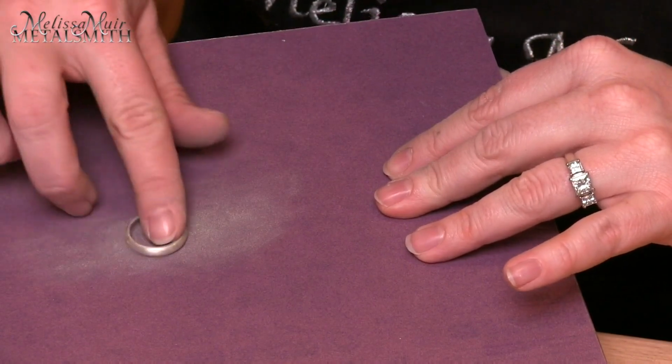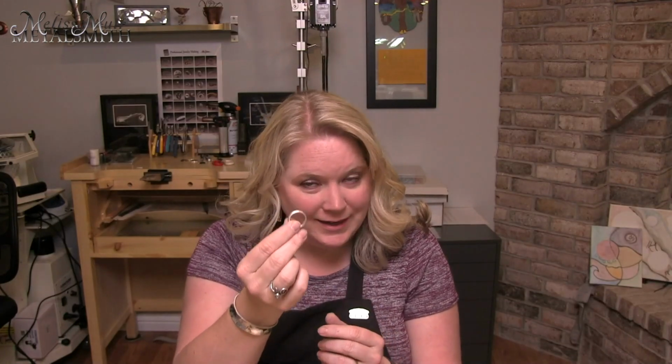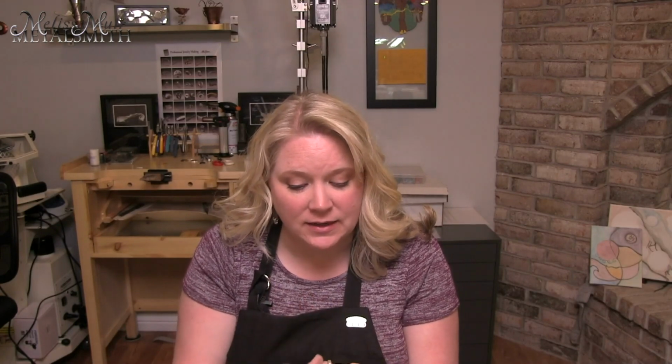All right, that's looking really good now. At this point, we have a nice, perfectly round ring. At least that's our goal, is to have that round ring. You can no longer find the seam inside or out because you've cleaned that all up. At this point now in my ring, everything has been sanded. I have Scotch-Brited the surface. That's going to enable us to see the marks that we are going to make on this next section.